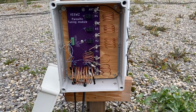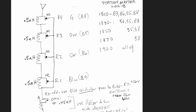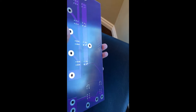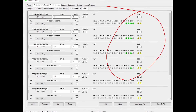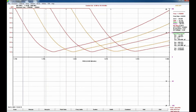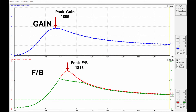The element is tuned at the top of the band, then each inductor is switched in to increment the tuning down to the CW end of the band. These modules were quite affordable to build using those 16 amp Omron relays and a PCB that I designed in KiCad and had made in China. CAT data from the radio — using something like Station Master, like I do, or even the PST Rotator program — can drive the relays, so the relays increment to follow the radio automatically based on band segments. This is how the SWR sweeps look as they move across the band, but what really matters is that the parasitic reflector tuning is also moving to maintain max gain and front to back.